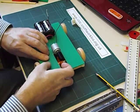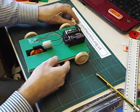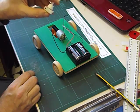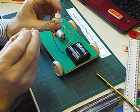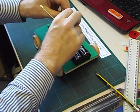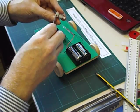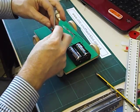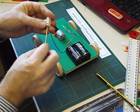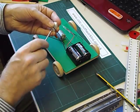It's quite nice to leave the wires clearly arranged so that pupils can follow the circuit. And between here we're going to put a switch — we could make a switch out of paper fasteners and paper clips, but I'm going to use a bolt switch. This is a push on, push off switch with a terminal at each diagonal corner. Undo the screw three or four times, fold the end of the wire and poke it through the hole in the corner, then tighten it up. Do the same for the other wire — don't undo the screws too much because they are very small and if they fall on the floor you'll be hunting for them.